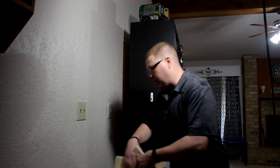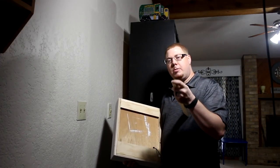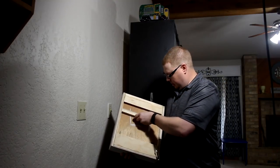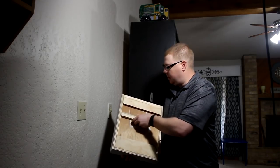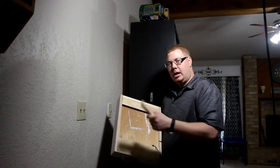One other thing: I did this off camera — you saw me cut the French cleat at the 45-degree angle, but I used the miter saw and trimmed off about a blade width or less so that when it sits in here, it's got a little bit of play. Very little play. That's just so it'll sit in there a little easier and won't hang on the sides and give you problems.